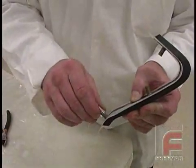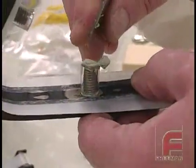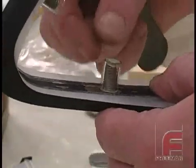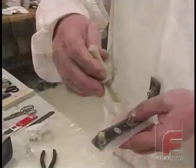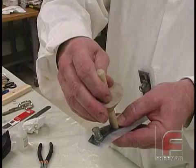Next, we cut small pieces of plastic to cover the threads, and then we fill the ends with clay. This will prevent the silicone from locking around the threads when it is poured. Here we are gluing our down sprue onto the part itself. This will create a cavity in the mold that we will later use to pour our urethane.